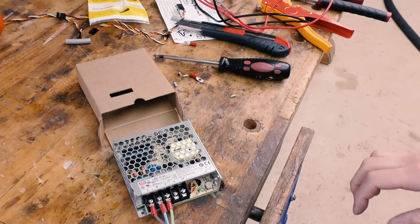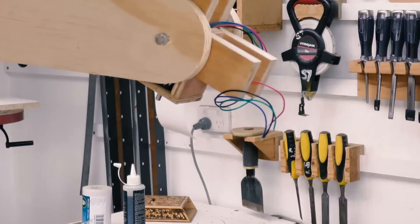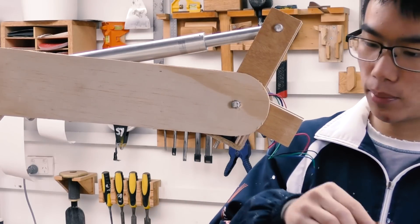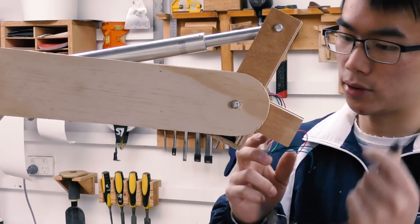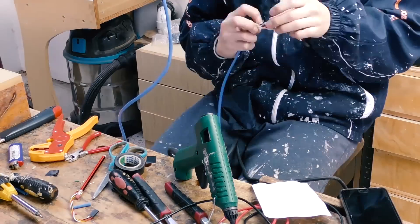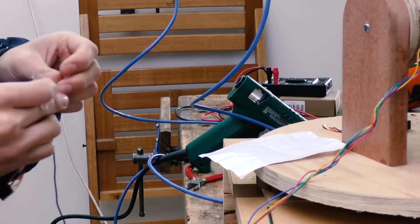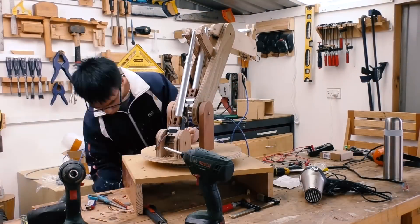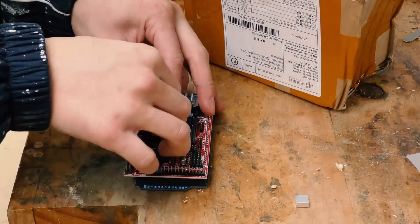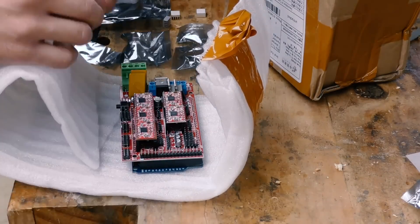Okay, turn this thing off before anyone dies. If the voltage wasn't right I could just turn this knob right here and that would adjust the volts. It's kind of ironic that I put all the small motors at the end and all the small motors have the shortest wires - kind of sucks. So I have to extend these and I'm also planning to put one of these connectors at the end so you can just plug into the shield. I ended up here and since I didn't have a soldering machine, the way I joined the wires was to twist them together first, then use some hot glue, and then wrap it with electrical tape. The hot glue will probably melt due to heat and high amperages, so do not do this at home - I only need it to work once. Now installing all 5 of the motor controllers onto the shield - they have a really specific orientation so you really have to look out for it.